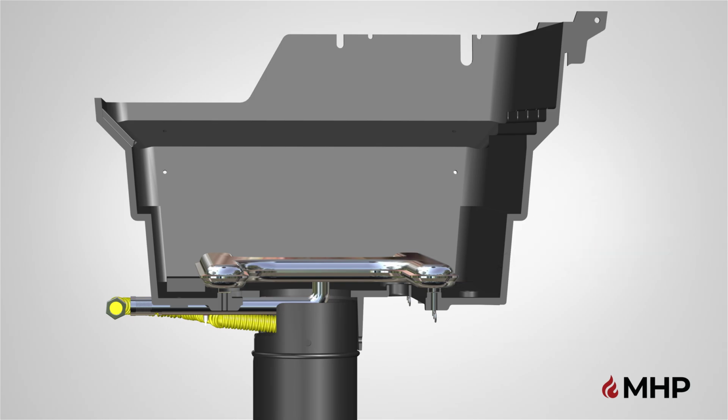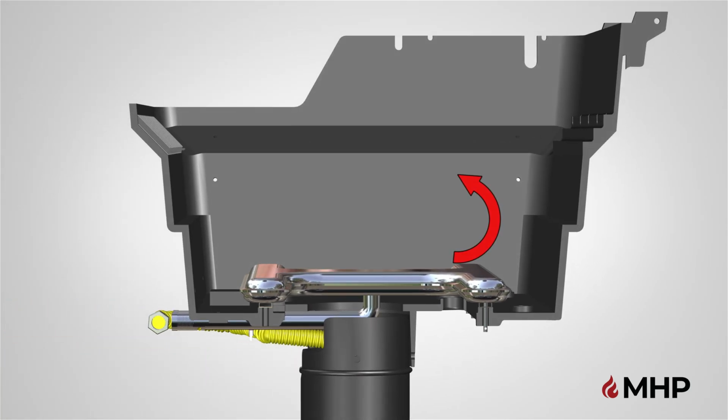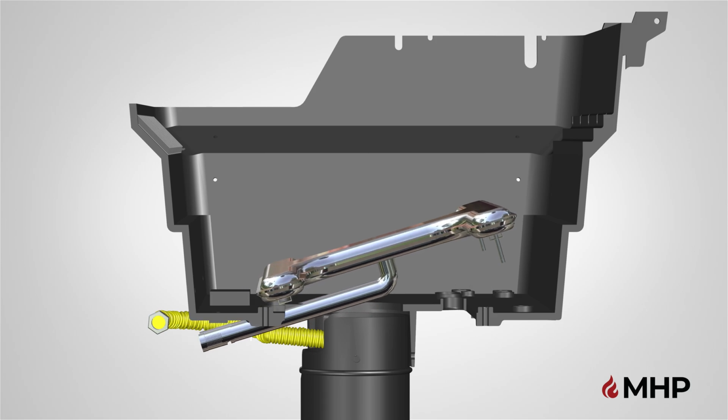Next, remove the small clips located on the back, underneath the grill. These small clips are part of the burner and need to be detached in order to remove the burner. Once the clips are detached, slowly remove the burner. Pivot, and slowly pull the burner out and set the burner aside for now.